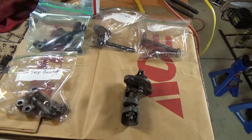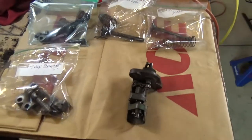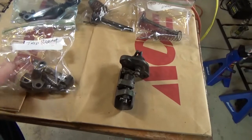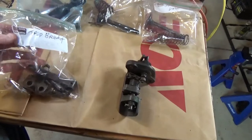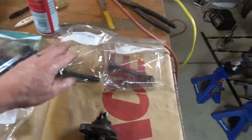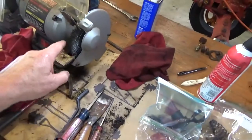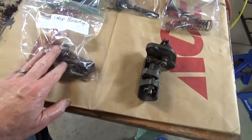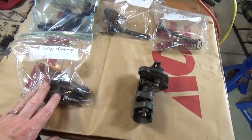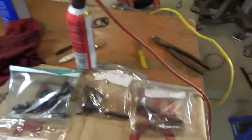Pulled the head off the hit-miss engine this afternoon, and it's been a good amount of time scraping off old grease and caked-on muck from over the years. Stuff doesn't come off easy. I disassembled the trip bracket, the exhaust lever, and pulled out the exhaust valve and intake valve. Valves are in great shape, and with the aid of my grinder with a wire brush, I was able to take off all the caked-on grease and muck. Right now I have the head over in the electrolysis tank, along with some other components.